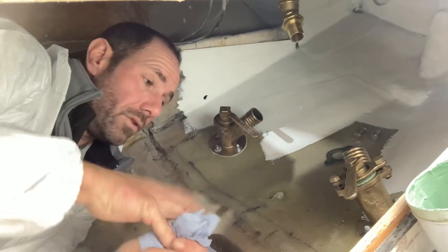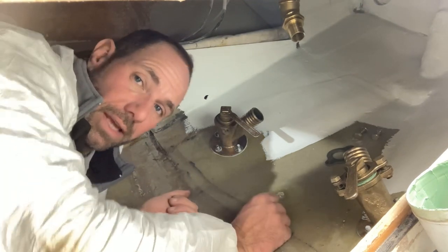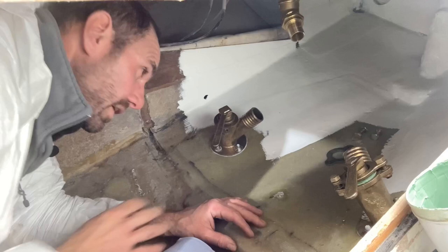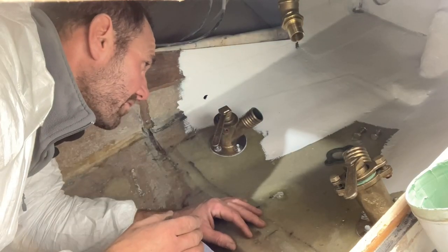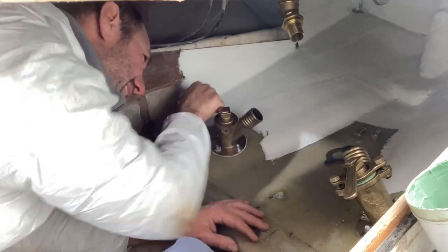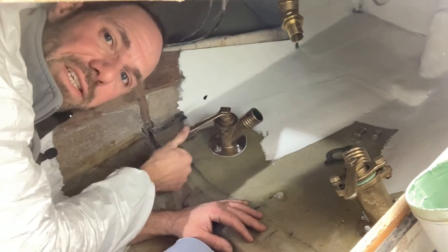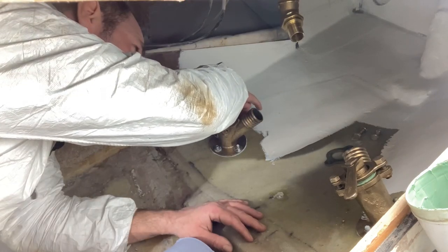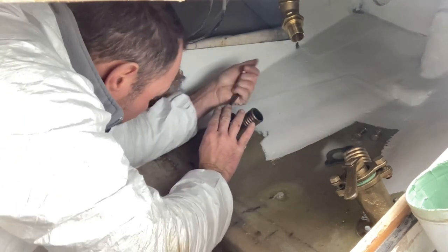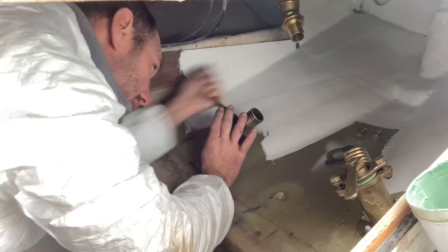It's worth putting it on fairly evenly around if you can. Try and get some on that very end bit there, because that bit always seems to get missed when people do this. Chuck the cone back into the valve body, and then work your valve back and forth evenly to get that valve grinding paste to do its job. Do a couple of full rotations to start with, just to make sure the valve grinding paste is evenly distributed, and then give it a good wiggle. Try and hold it in the middle and just use the valve handle to rotate it, rather than pushing down on the valve handle.